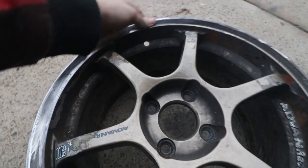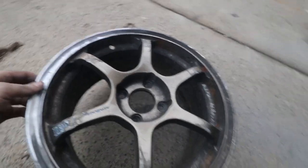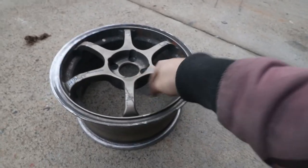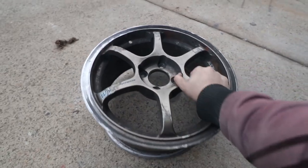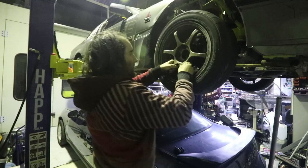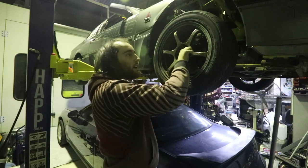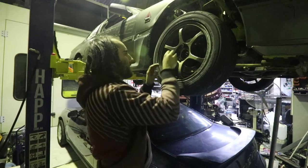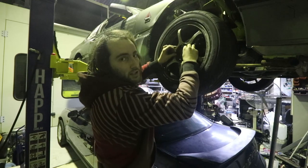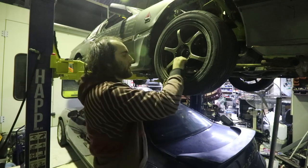The main thing is this edge in here is straight and free of defects. There are a few wobbles in the outer lip which is just aesthetic — if you wanted, you'd put some extra bead in and weld it, but I don't care. I've ground most material out just so the wheel's not super off balance. If you wanted to get a die grinder and really shape it nicely, then a colour-match can of paint, no one would even know the difference. And because it's just the outer lip, this wheel is still 99% as strong as it was when new — if you'd snapped a spoke and tried to weld it back together that's a different thing, but this one I'll chuck a tyre on it and it's ready to go back on the car. The wheel's got the tyre mounted back up now; you can see the repaired section, it all looks pretty solid, it holds air, beaded easily, and it all turns true. Hopefully I get to give it a test run on the weekend — there should be a video of that. Remember to give the video a like if you liked it, and see you on the next video, goodbye.